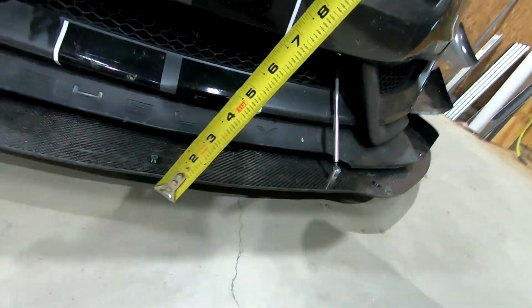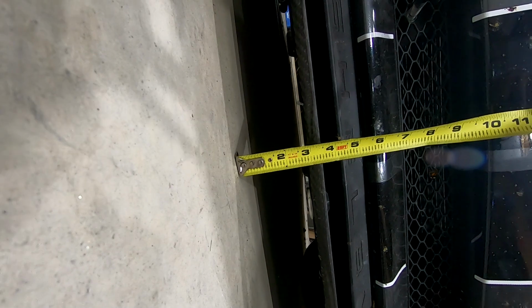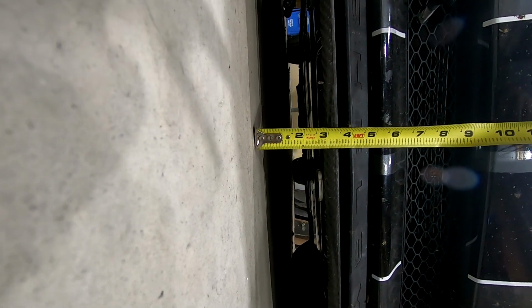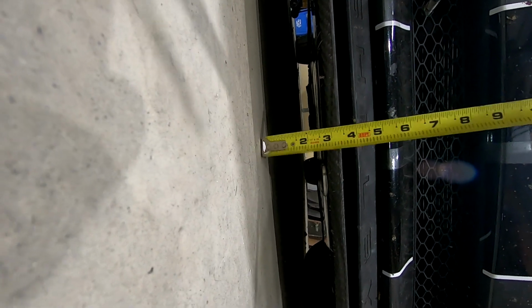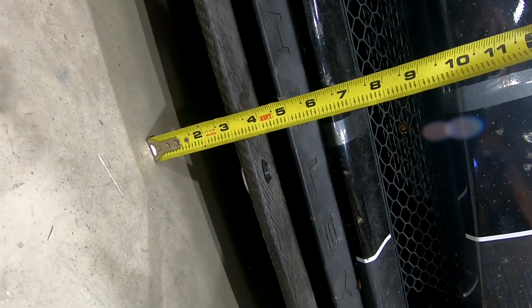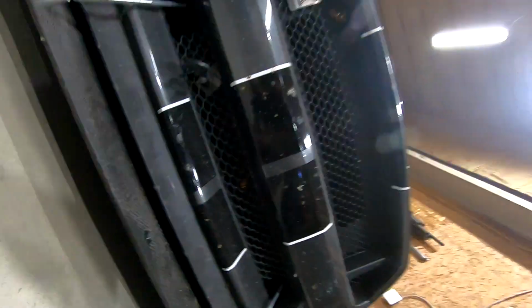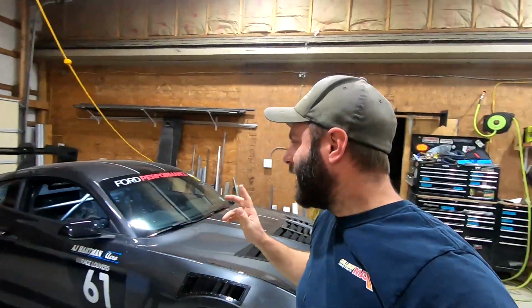Alright, so very first thing we're going to do is take a measurement. Right now the car is sitting like it normally would, and we're at like 2 and 3/4. Actually, you know what, we'll go to the flat top, because that's a little bit more precise measurement. So we'll call it 3.5 to the top of the splitter right here. Yeah, about 3.5. If you watch my channel, I kind of showed this in a previous video last time I was out with this car.